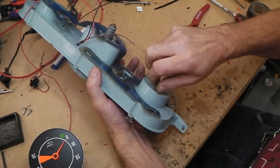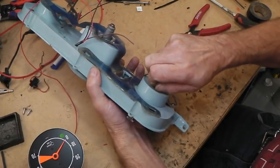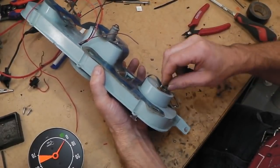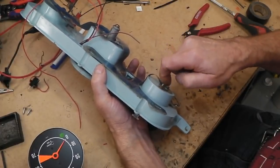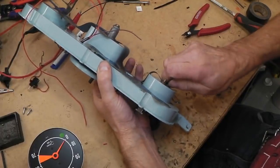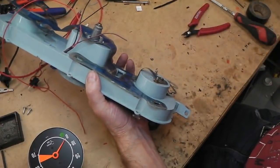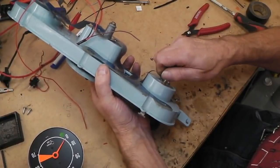Circuit board I've got there is Bramble's original. It's damaged, but it's not badly damaged. It's only damage on one of the bulb holders. Rather than go pinching another, I'm going to repair Bramble's. It's just the one bulb holder, we can fix it. Because they're LEDs, we can solder into the harness, into the pins of the lamp holder, because we'll not be changing them for 50,000 hours.